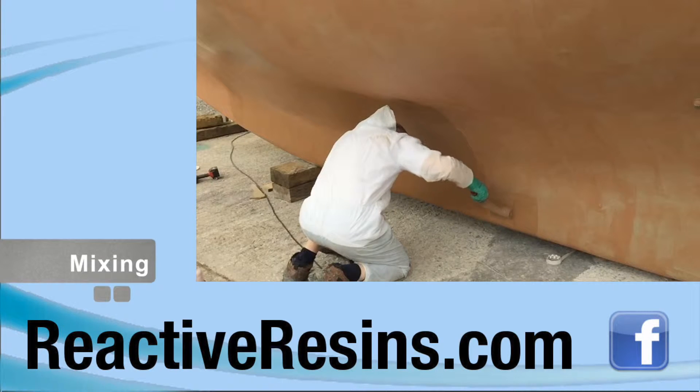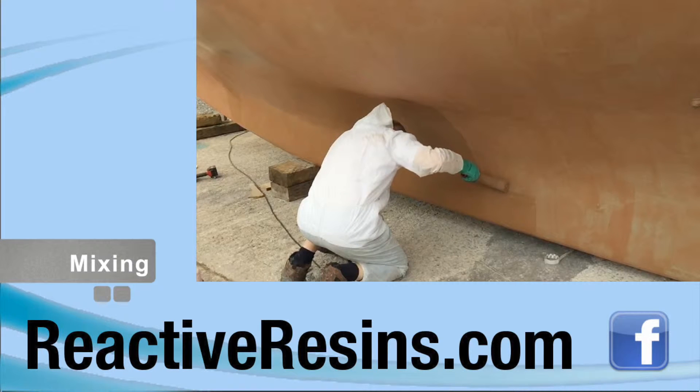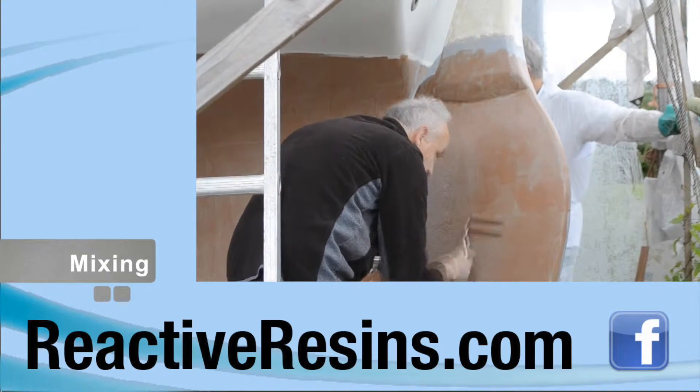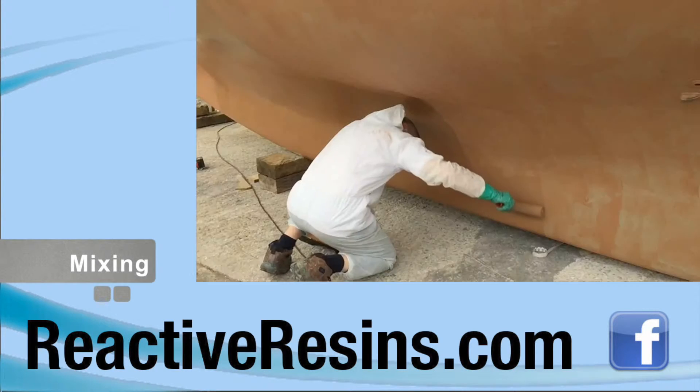Synergy can be applied at any temperature above five degrees Celsius. However, because it's waterborne, the water must be allowed to dry from the coating before it cures. Therefore, the relative humidity mustn't be excessively high. A gentle breeze will help with drying. Generally, if it can dry within two or three hours you'll see the best results.